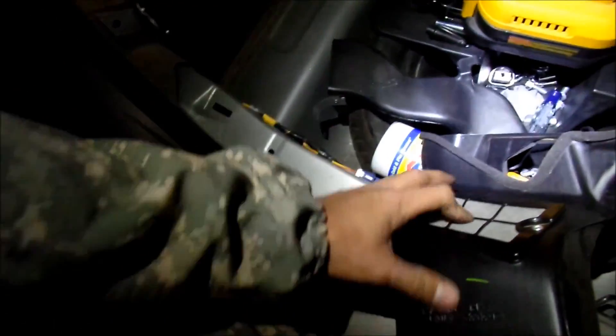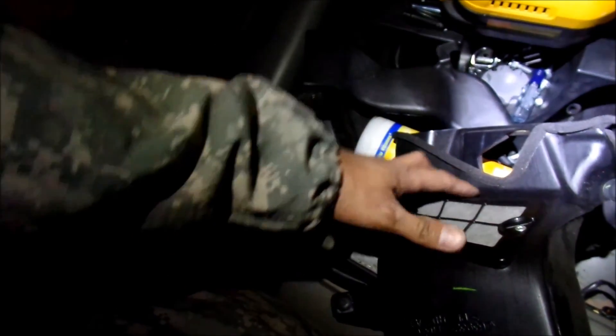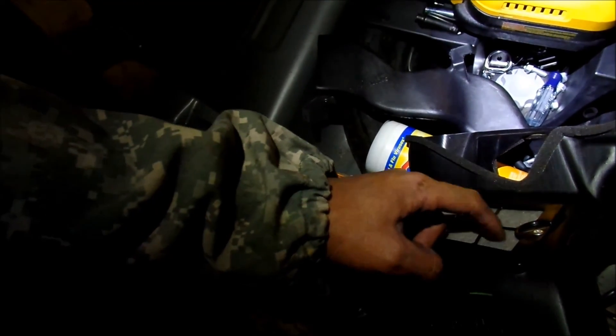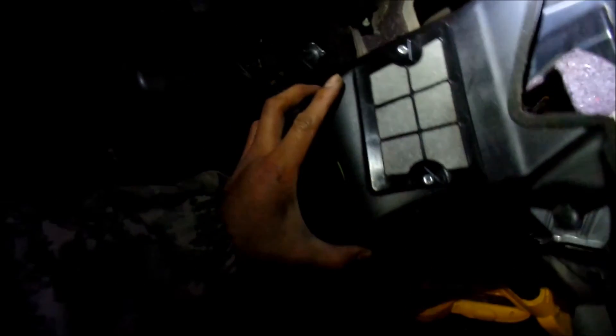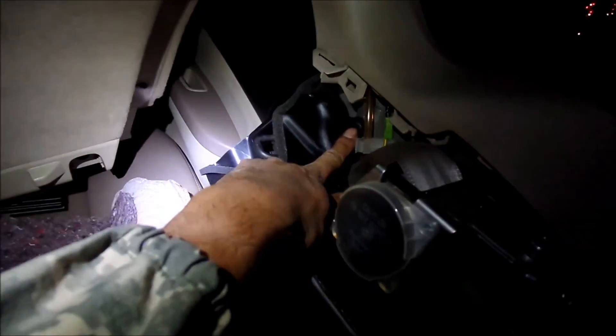I just wanted to point out that when cleaning these ducts, there are things that kind of look like air filters. They're flimsily put on but there's a felt-like material in here. I blew it out with the blower and a bunch of dust came out, so that's not good. There are two of them on this one — these are the only ones that have it. This one goes right here. You have to pop this clip off, and I used a small pry bar since it's kind of hard to get to with a screwdriver. There's another one right here that just slides right out.